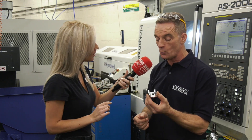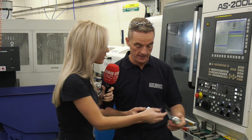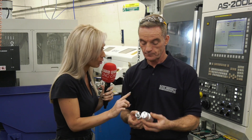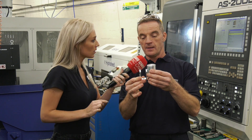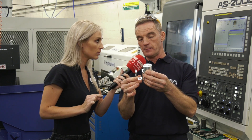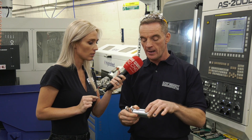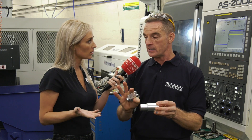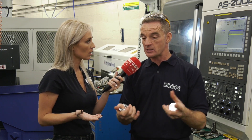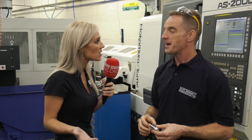And this is only just one particular part. Can you show me the original billet you were using? When you say less material, you used to have to hold part of the part. That much material there — approximately 19 mil — we don't waste that anymore. That was just used by our milling section to hold onto while he milled. We now don't need that; we probably use half a mil each end, so we're wasting about a mil on that particular part. Over a large batch, you're talking bars of aluminium that are not cheap.